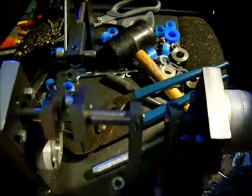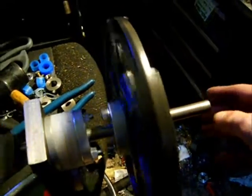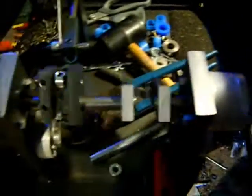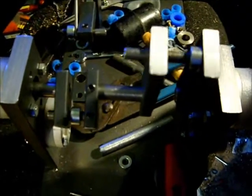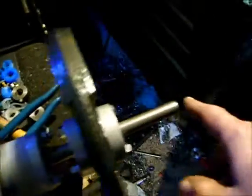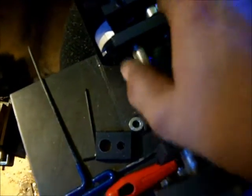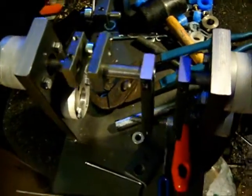We completed the new crankshaft configuration — it's just a rough fit at this point. The problem in the past was the runout on the shaft was so bad that it was unusable. We learned how to drill a more perpendicular hole. There's still a little bit of wobble in the center shaft, but it doesn't really affect the runout on the end of the shaft too badly. Also, if we take the time on the final installation to align the lobes, that will reduce the wobble in the center as well. Hoping it to be functional at this point.